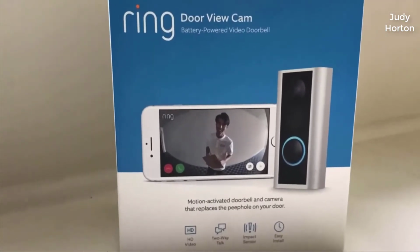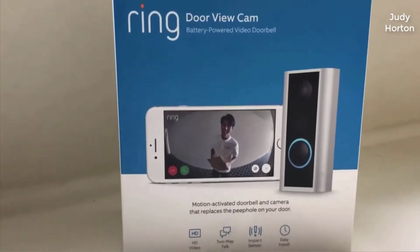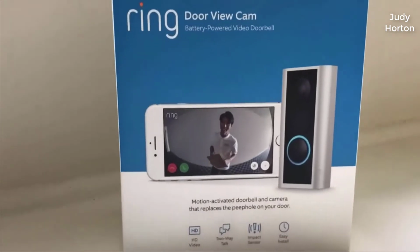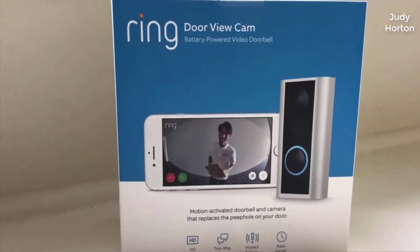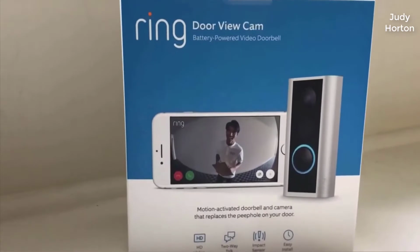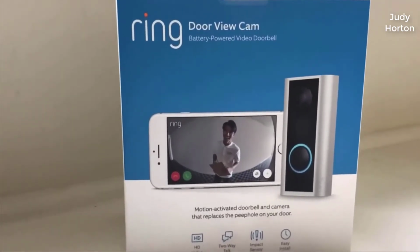If you've seen some of my previous reviews or read some of my previous blogs, you know one of the challenges about having an actual smart doorbell is that it requires a lot more continuous voltage from your doorbell chime itself, and if you have an older home, you might not have enough voltage running, and you run into things like the doorbell constantly hammering and making noise, or the video feed not even working properly, not even being able to capture enough power to continuously power.